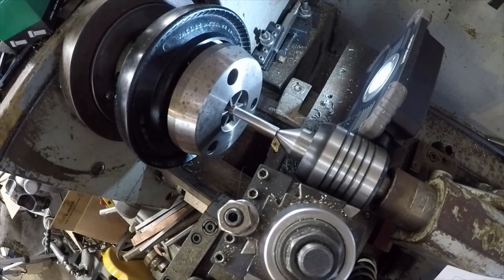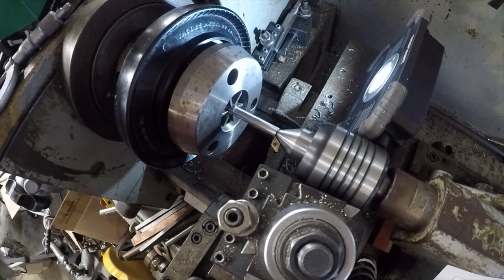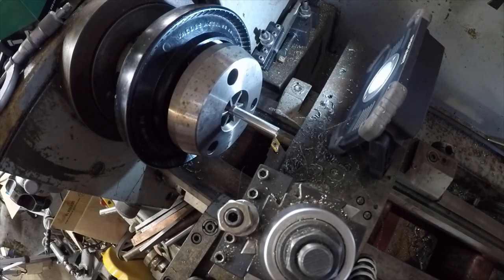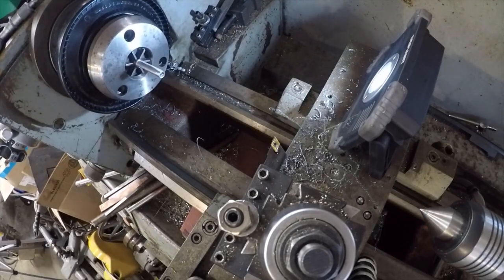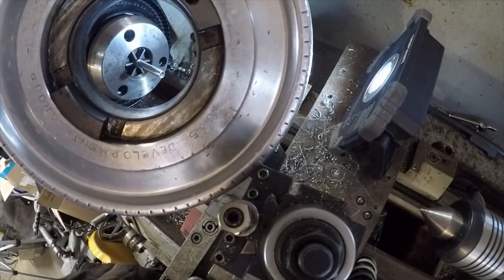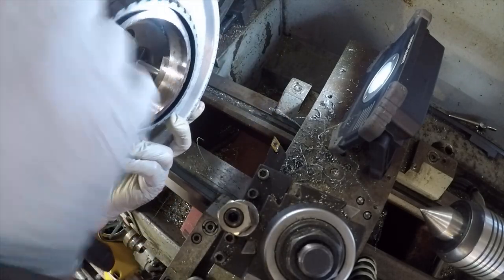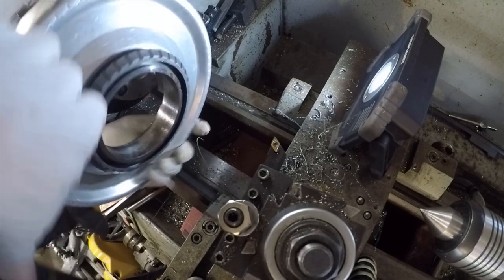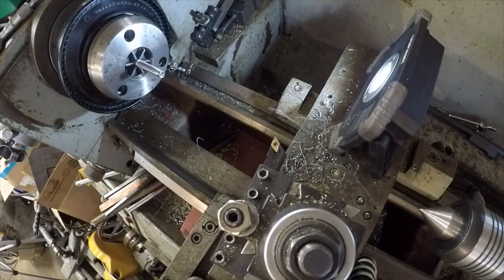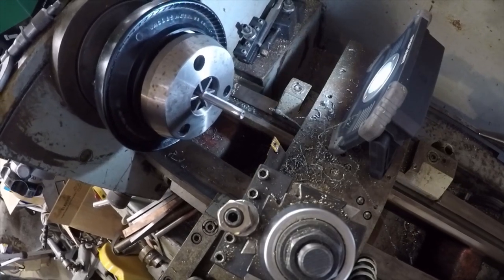I think with the wear that we've got, let's break it down here, give ourselves some room, because I don't want to get too loose at the same time. That hole is where the pin's going to go through, so that's where it's going to live. Okay, that's kind of snug there, and that's going to have to be a sliding fit. So if we take a little bit, maybe two, we'll probably be right in the ballpark.